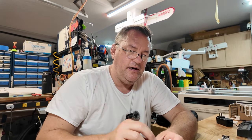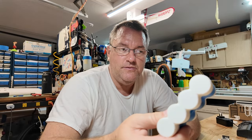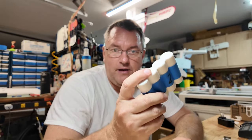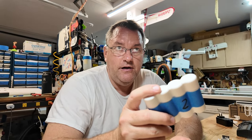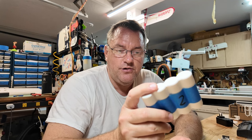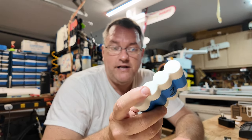There's nothing wrong with flying with lipo packs. The lithium-ion cells, to me, just represent a better value and bring a lot more power in terms of their dischargeability. Bear in mind where that power lives — it tends to live on the backside of the power curve. You can frequently take a lithium-ion cell down under three volts per cell, depending on the manufacturer's data sheet. In a 3S scenario, if you go below three volts per cell you're down around nine volts, and certain electronics — BECs, flight controllers — may have cutoffs where they can't boost the power, so you tend to get brownouts, which can be a problem for certain receivers.